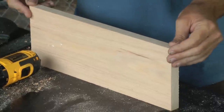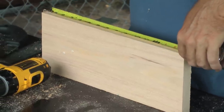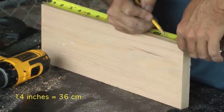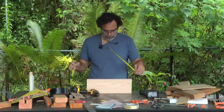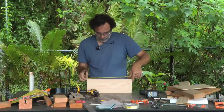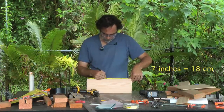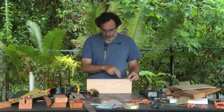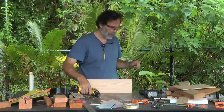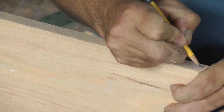This one is at least 14 inches long — that's how long our proportional divider is going to be. So I will put a mark here at 14 inches. This is where we're going to take our proportional divider from. And then I'm going to put a halfway mark at 7 inches. Then put a line down the center of this piece of wood exactly down the middle. Really take your time and make sure that it's a nice straight line right down the middle.